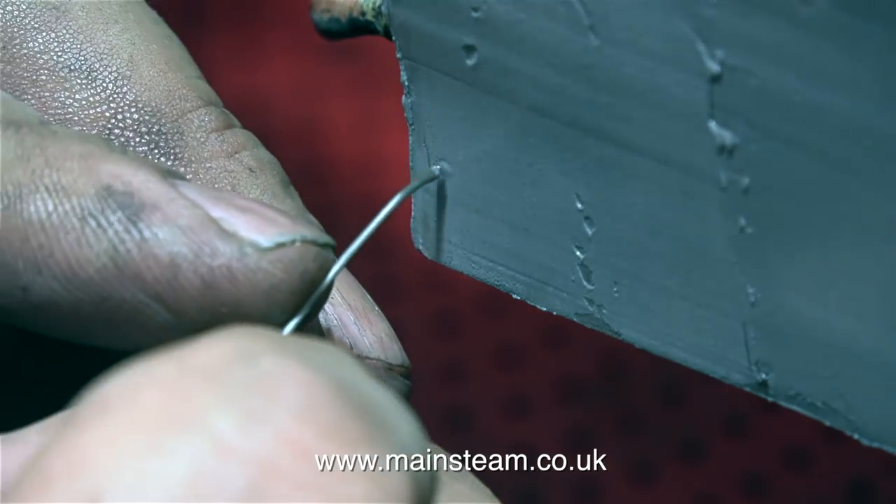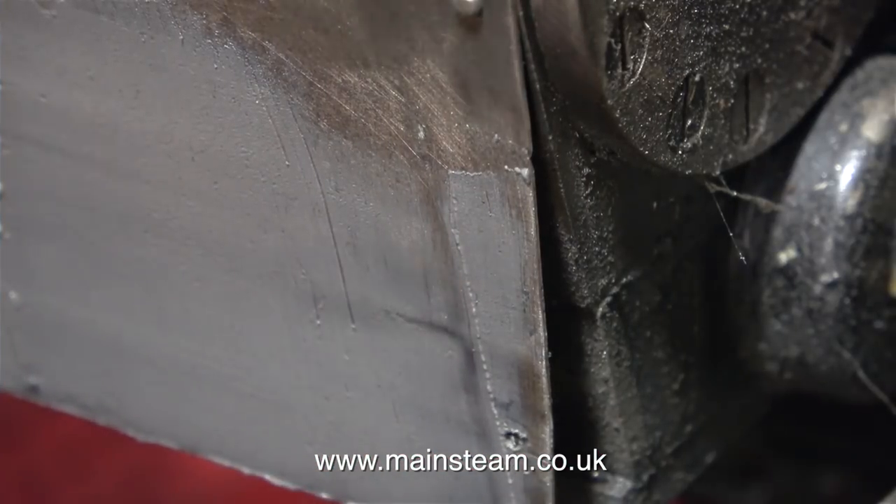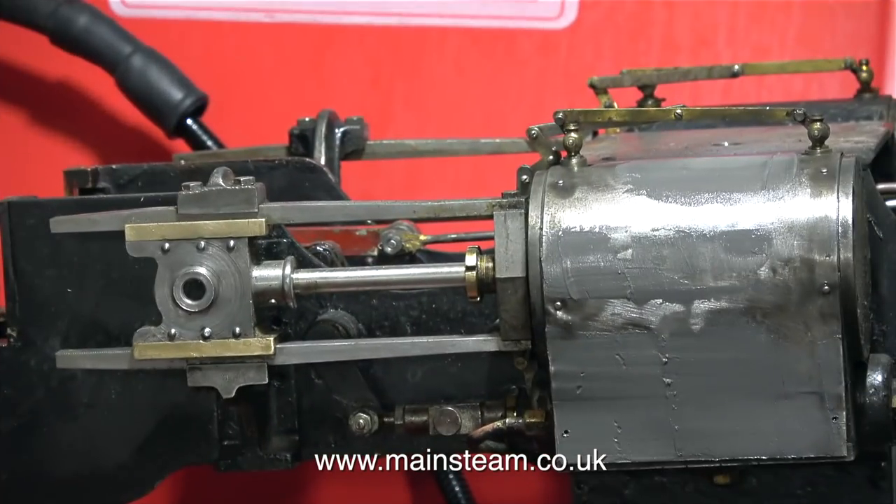You've been watching me applying the JB Weld to the cylinder cladding. And here I'm just poking through the holes which later will take a bolt to hold the cylinder cladding to the steam chest at the top. There's nothing more I can do in this episode — I just need to leave the cylinder cladding for 24 hours for the JB Weld to set, after which I will rub it down again and get a really super smooth finish. So that's it for this episode. Thanks for watching, and I hope you found it useful.